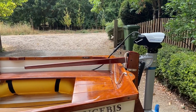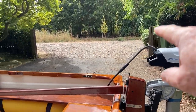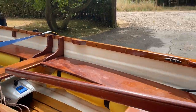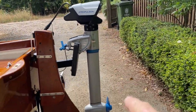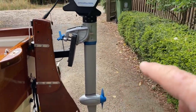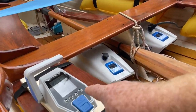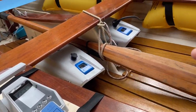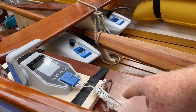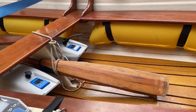As a recap: we've got the outboard mounted on the back without the battery on it, a cable getting power from either of these two batteries stored under the thwart — keeping the weight nicely forward — a very simple, lightweight, silent engine. The motor is down there; you could almost get away with just that bit, it's really like having a prop on a prop shaft coming out from under the boat. And the remote control handles forward and reverse throttle. The man-overboard kill switch will be attached to me, and I'll be sitting right here, so I don't even have the problem of the string getting caught on things as I move around.